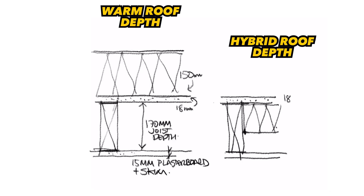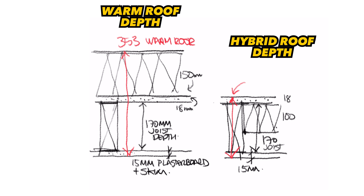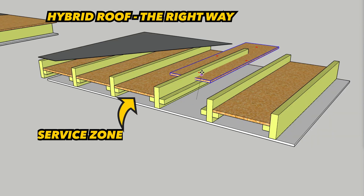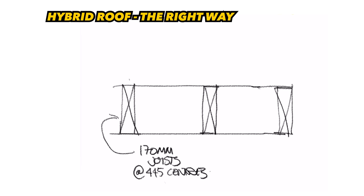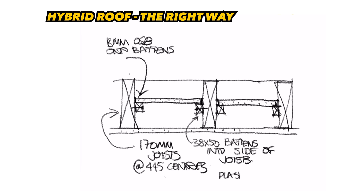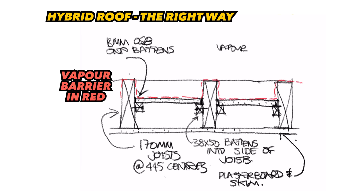So what are we going to do about that? First, we'll line our joist gaps with 18mm OSB fixed with batons — this also gives us our service zone for cables, and if you really want downlighting you can put that in as well. Instead of running the vapor barrier below the joists and above the plasterboard, we're going to solve the problem of cutting holes for services and lighting by eliminating those issues through good design. We've now created the option to run the vapor barrier above the deck, up and over the joists, and lap it around at the edges.